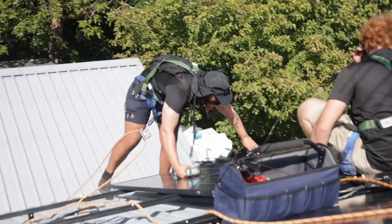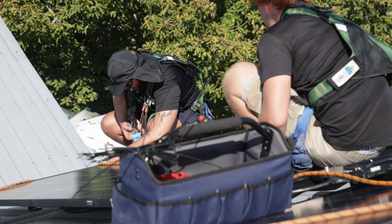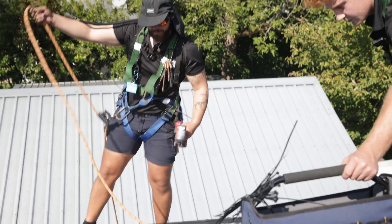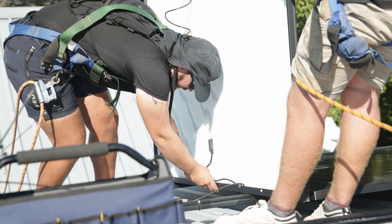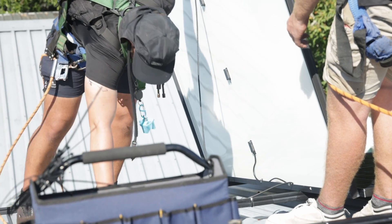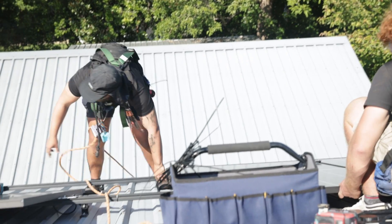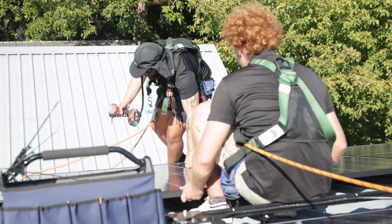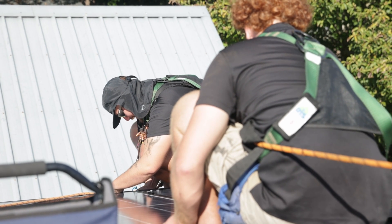Spanish terracotta, 30 degrees — at least we don't have bees. We've got the positive and negative ends of the panels here, clipping them all to the panel using some DC clips so there's no sagging cables — just in case the wind blows around and wears down the insulation, potentially causing a short circuit to the roof. We do earth the whole system — earth the rail, earth the panels — just in case that does unfortunately happen, though in my time here I've never come to that conclusion.